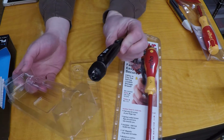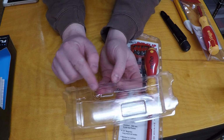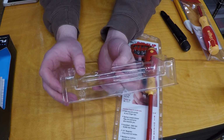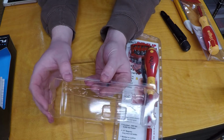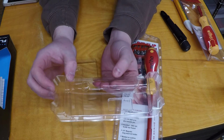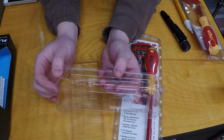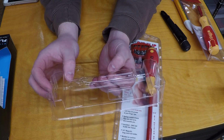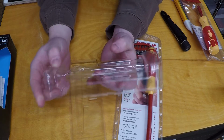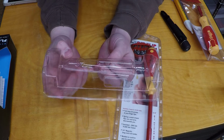Says so right on there. So I assume their packaging is, but I was kind of impressed or amazed that they had polished this mold so well. Normally when you machine a thermoform mold, especially in Asia or in China, where it's a low-cost packaging mold, they don't polish it very much. They leave the machining marks in there. Of course, the life of the mold is greater if you polish it, and the results are much better, obviously. But they remove most of the machining marks.